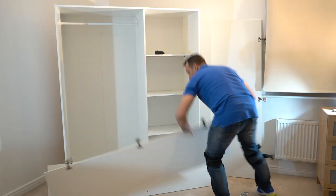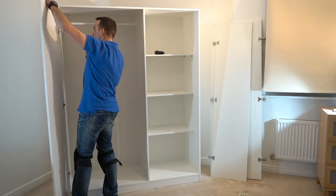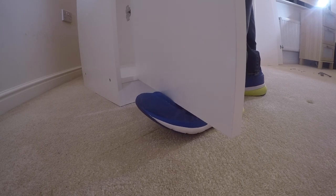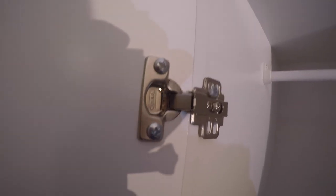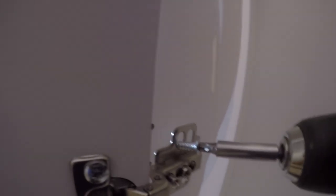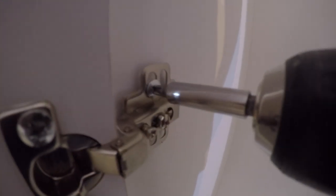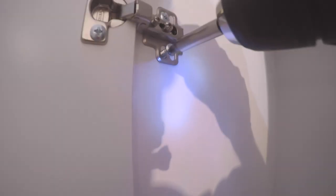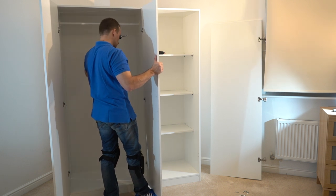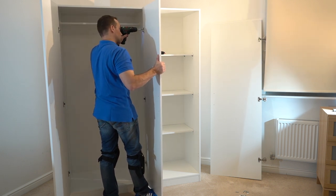We can place them on the side. Starting with the two smaller doors — I'm using my leg to support the door because I'm working alone. If you have a second person it's useful, but you can do it alone with one leg under it. You can adjust the height of the doors this way — very easy and simple. Place the top screw, adjust the height of the doors, add the second screw, and secure it where you want them. After that you can tighten up the middle and the top screw and secure both screws in the hinge. When you do the other door go to exactly the same height, so you don't need to worry. You'll just adjust the doors left or right depending on the gap in the middle — I'll explain how to do that in a moment.